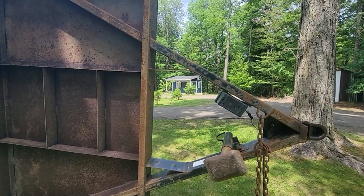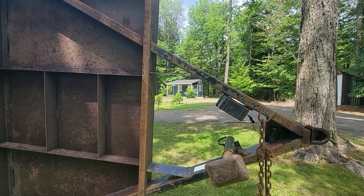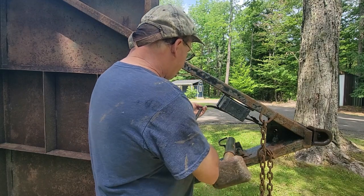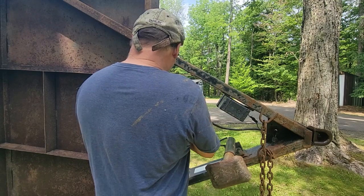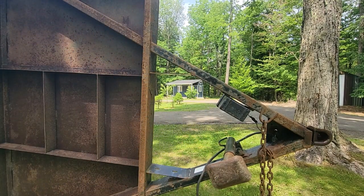And what I want to do is finish drilling the hole. And I think the diameter of this, because it's got the sheathing over the cable, I'll probably want a 3/4 inch hole in that. So I'm going to keep drilling here.